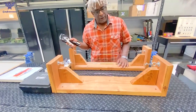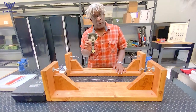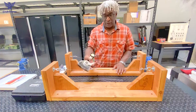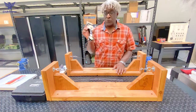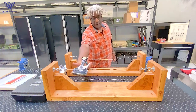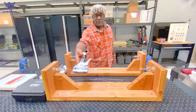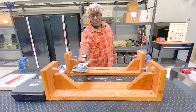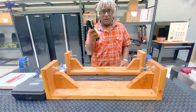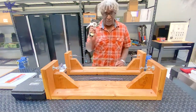I could jot that down and see if it's within spec based on the manufacturer's data, and I could adjust the turnbuckle to loosen or tighten to get where it needs to be. One other cool feature about this tool is: what if you're in an area where you can't read the gauge — you can't put the cable on and read it? This tool has a hold function. I can reach into that inaccessible area, get my reading, use this pin to hold it, and then release it. When I come back to it, the face still has the reading on it, so I can still take a reading even if I have to reach up between other cables or through a bulkhead.